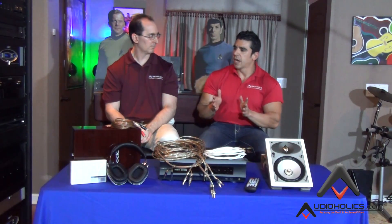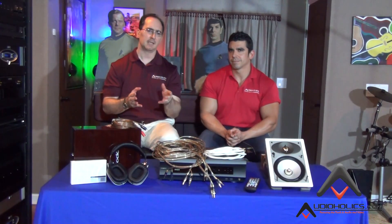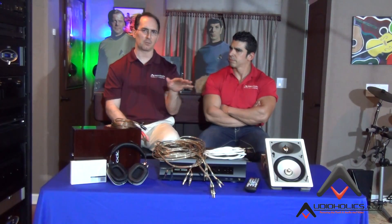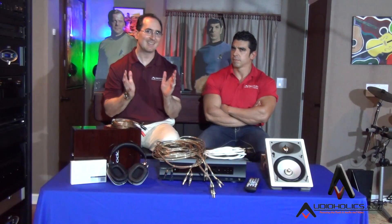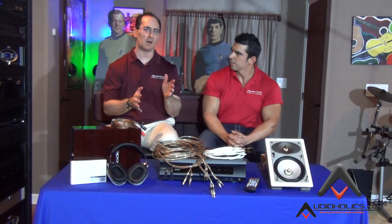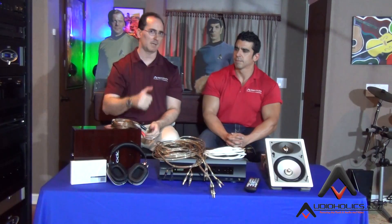For the neophytes out there, could you please define what skin effect is? Skin effect is basically a measurement of how the AC resistance of a cable changes versus frequency, because as the frequency goes up, the current flows more on the surface of the conductor. A lot of people won't even tell you this, but the internal inductance actually drops. You can see this when you measure the series inductance of a cable. We've measured high-end esoteric cables that show a flatter inductance profile up to 100 kilohertz, but the problem is their basic DC resistance is much higher than standard 12-gauge zip cord. So in actuality you have more impedance loss and more insertion loss from the skin-effect-free cable than from a basic Home Depot cable that has low resistance to begin with.